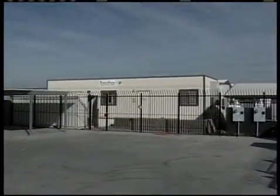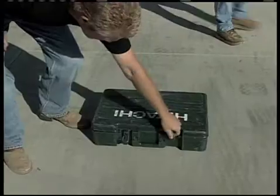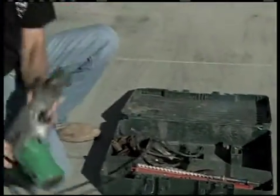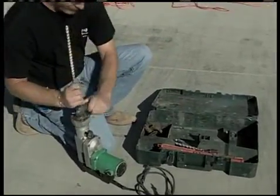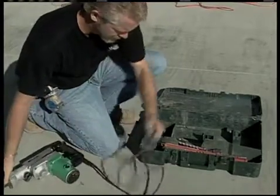Now, assuming you're mounting your structure on concrete, you're going to need to drill holes in the concrete, which is really easy if you use one of those bigger hammer drills with a 1/2-inch masonry bit. I know a lot of the regular-sized drills available these days have a hammer option on them, but a regular-sized drill just takes too long. You can rent a larger-sized hammer drill most anywhere, and it'll cut into the concrete like it was butter, saving you valuable time.